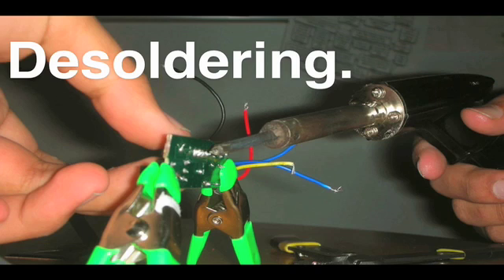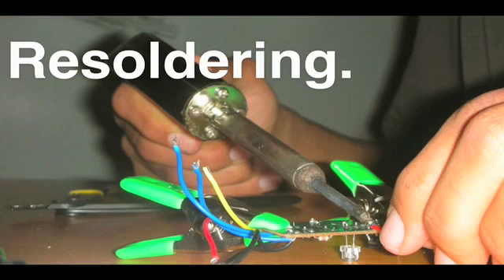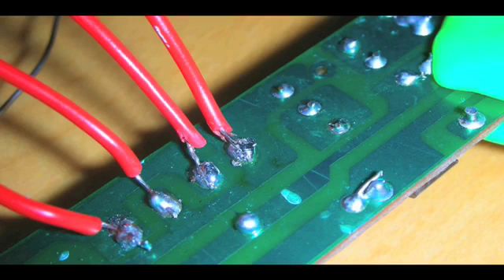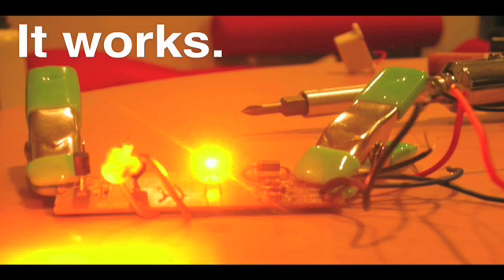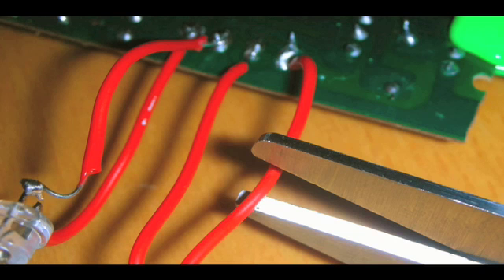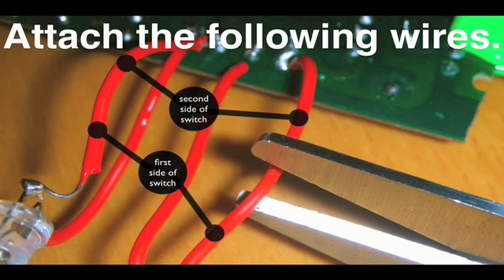Additionally, we are going to cut the LEDs off the board and extend them with about an inch of wire. After that is all soldered up, we are going to add a mini slide switch to turn the lights on and off. To do this, cut the left wire of each LED in half and use the mini slide switch to solder the four wires together.